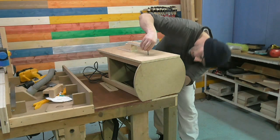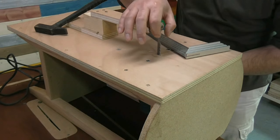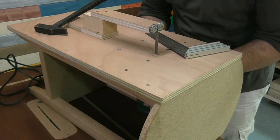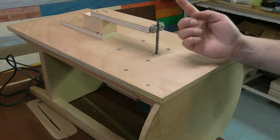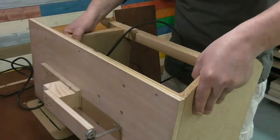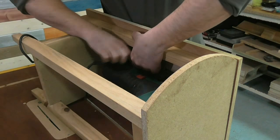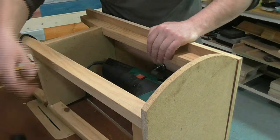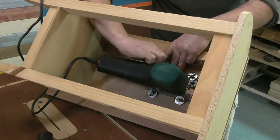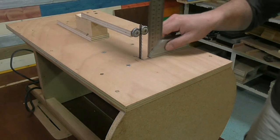I can install the blade. And the blade is moved forwards, so I move the jigsaw backwards. I check if the blade is vertical, but it is slightly inclined to that side. After I have a look under the board, I realize that the dust extraction pipe bumps into the back of the table structure, and one side of the shoe is not resting on the board. I remove the dust extraction pipe, and I make sure that all the base of the shoe is touching the board. And now the jigsaw blade is perfectly vertical.